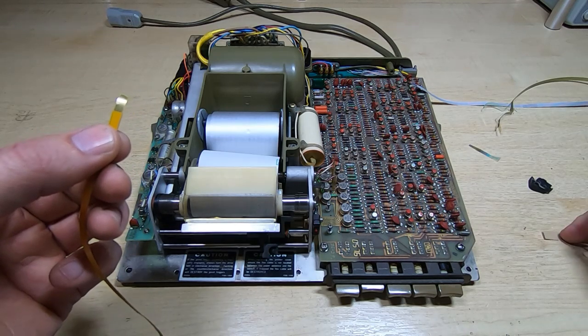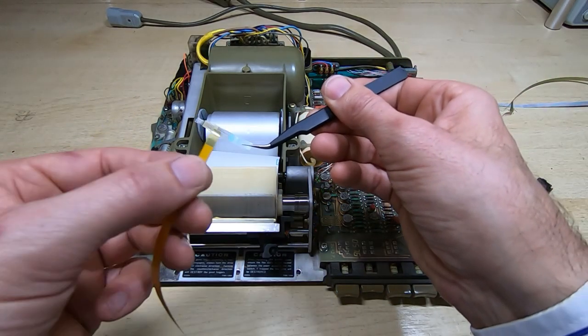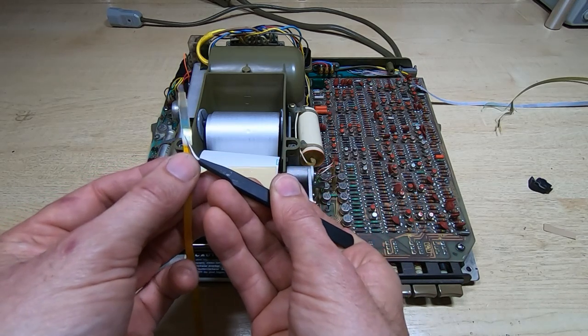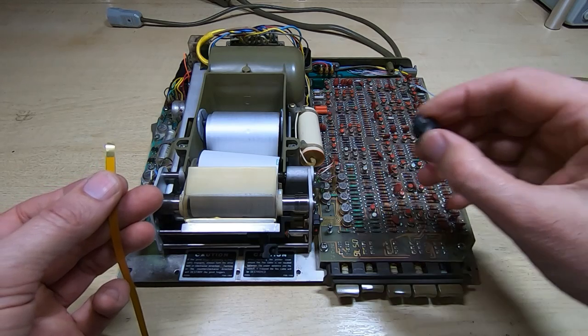And this will allow me to put a piece of this tape on this conductive surface, and on the other side, it will contact the tungsten that's been exposed by cutting this portion off, so this will effectively be stuck on to the end here, and then the whole thing will be put back into its carrier.